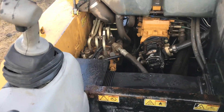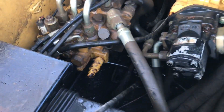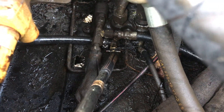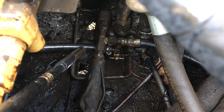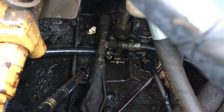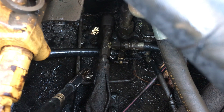Once you've got the cab up, you can get to your hydraulic fluid. Down here, you've got a petcock right there, and a hose on the petcock. You can slide that hose through one of these holes, then have your drain pan underneath and drain your hydraulic fluid.